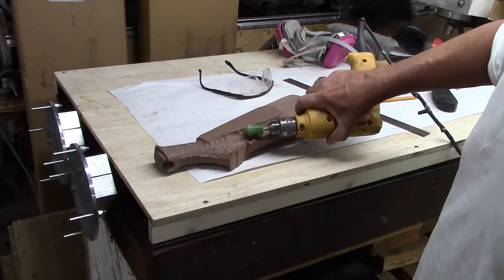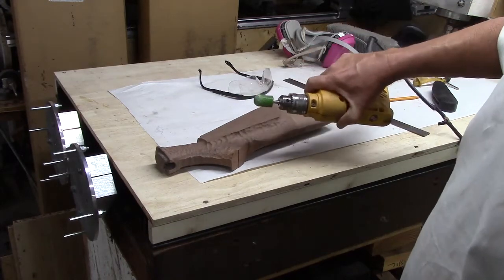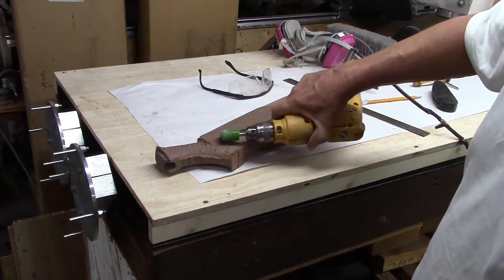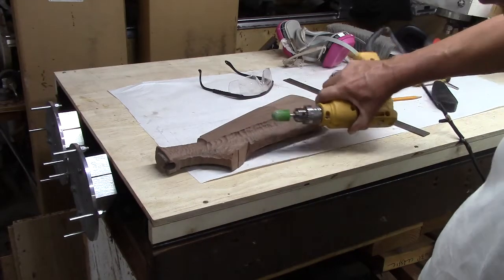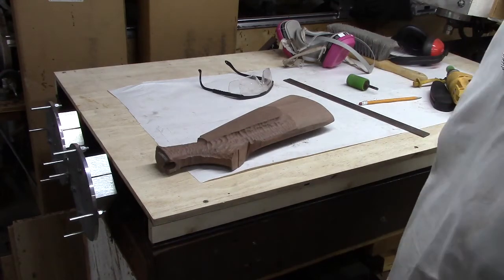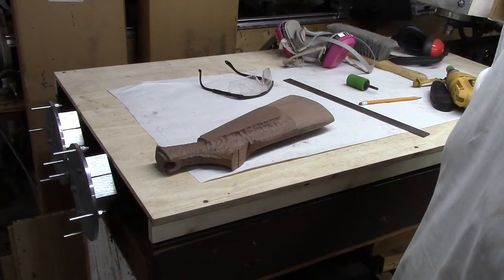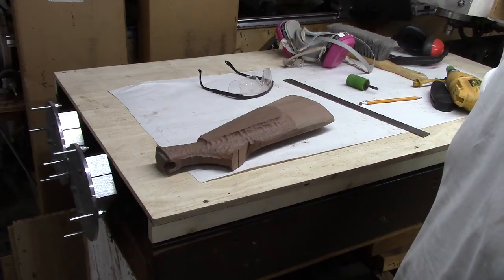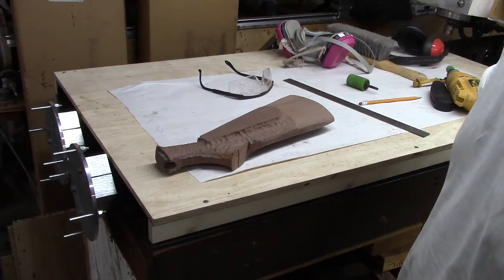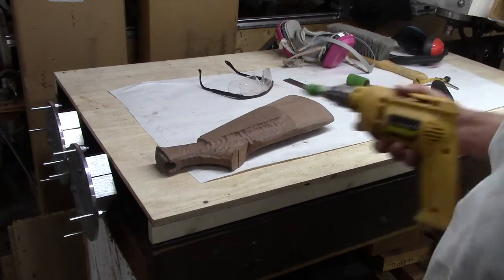when you're working around a curve, if it's trying to crawl out of there, you flip the direction the other way, and then it'll suck down into that curve. That's why flex shafts aren't so great. They don't like being run in reverse, because they're basically a coil wound steel spring in there. I mean, you can run them in reverse and be kind of mild about it. I have done that, but this actually works just fine.